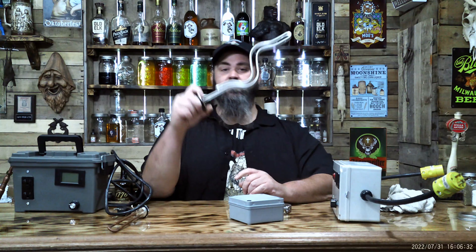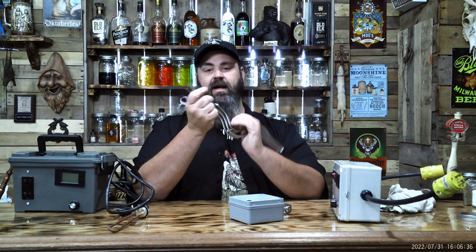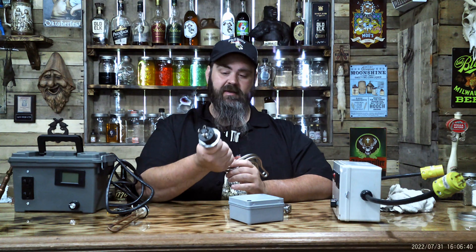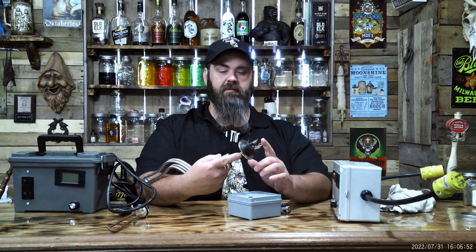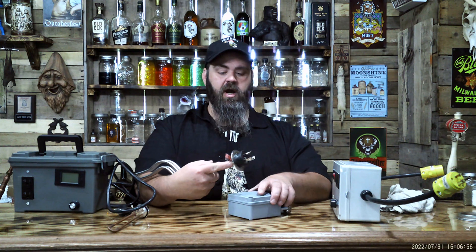The number one thing to run electric: always make sure there's liquid covering the element. The best elements, to me, already have a ferrule on them. I like this one — it's from Denord. I'm going to make a video on how to wire this up. I'm going to put this box on it. I'm waiting on a plug that's coming today. I'm going to run wires into the back of this, then out the side, and put the wire that runs to the plug that runs to this box. A lot of people make these. I'll put a parts list in the description — I think we got it from Texas Papa on TikTok.